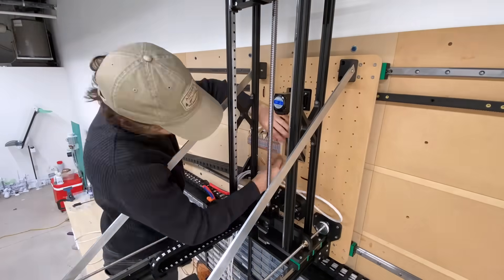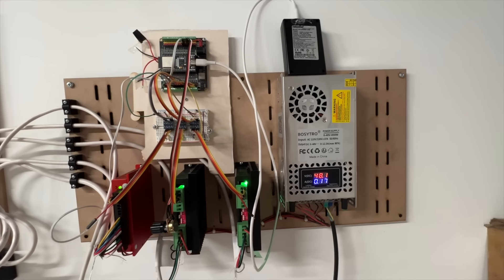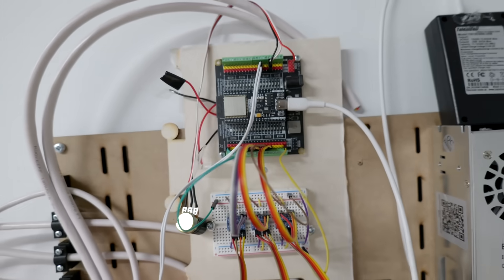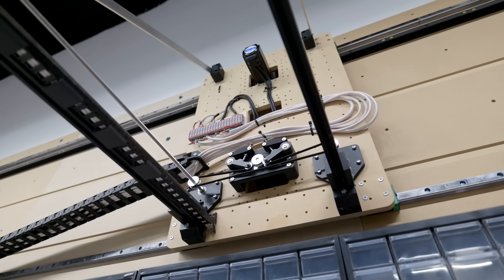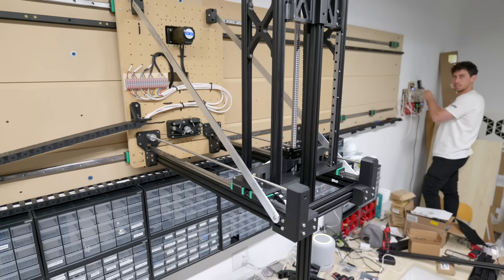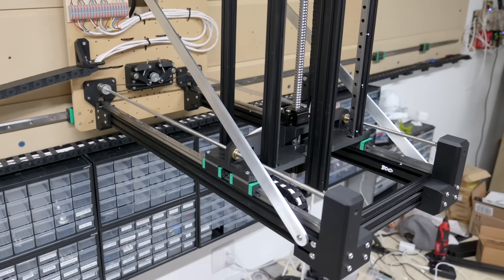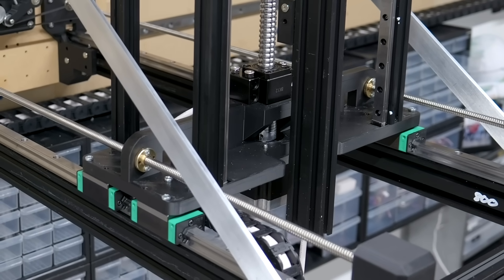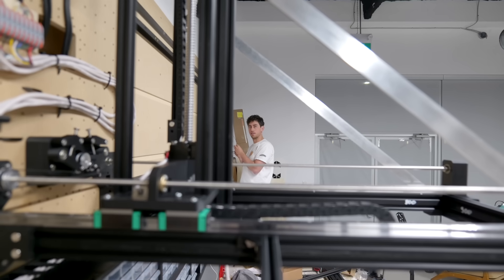While Mark took care of connecting all the wire ends and threading the gripper power cable through the z-axis extrusion, I put together a slightly janky but very functional CNC controller complete with three stepper drivers, a power supply, and an ESP32. Now it's finally time to see how the y and z axes move. Using a potentiometer to jog the axes, you can see how smooth the z-axis moves — the ball screw in combination with the linear rails gives seemingly effortless motion. The y-axis is a little crunchier, but it moves quite smoothly with the belt tensioning system working well and the lead screws moving in sync.